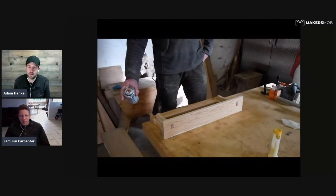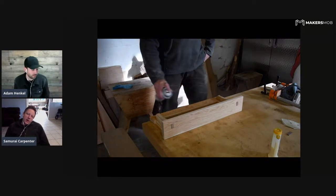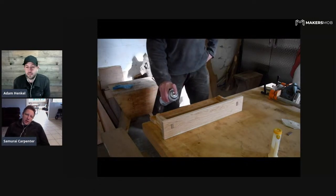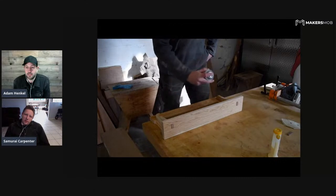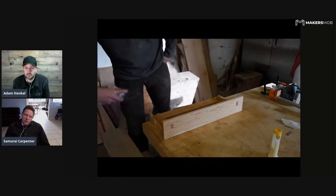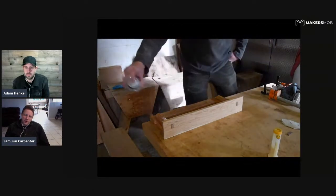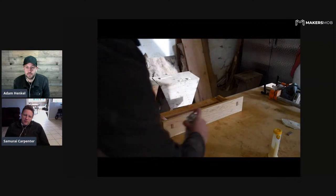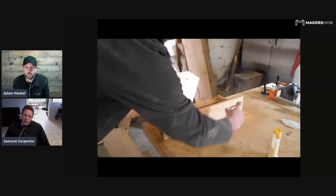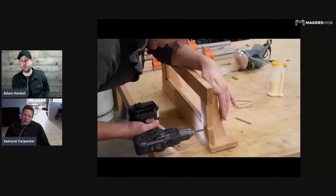And she's done. Look, clear lacquer. Obviously, you're spraying this before you assemble it. I would not use clear lacquer if I was to do that again. The finish is great, it looks great, but the spray bombs are garbage, and there's very little solids in them. I find that the lacquer looks great, but it's really thin and it wears off pretty quickly. Yeah, you got to do a lot of coats with an aerosol lacquer.